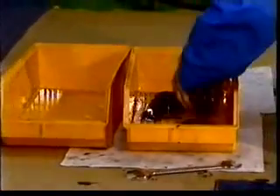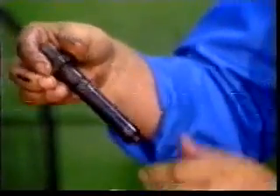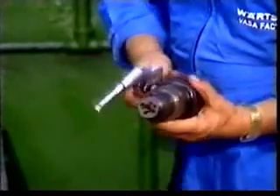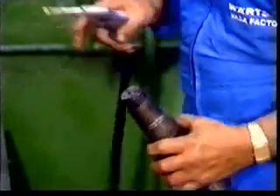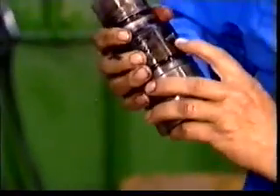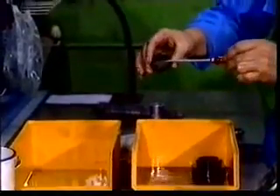Checking of the nozzle holder. Dismantle the adjusting screw from the nozzle holder. Remove the spring and push rod. Clean the nozzle holder together with the other parts carefully. Remove the O-ring from the adjusting screw. The O-ring must always be replaced. Dry the parts by blowing with compressed air, including the channels in the nozzle holder. Check the nozzle spring and the contact face to the nozzle and the bottom of the fuel inlet hole. The nozzle nut may hold some very hard carbon deposits inside which should carefully be removed.